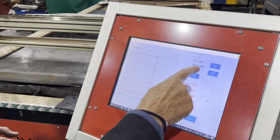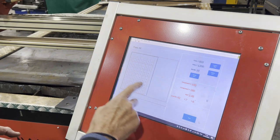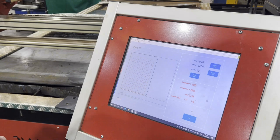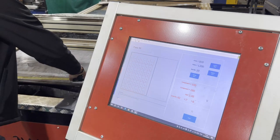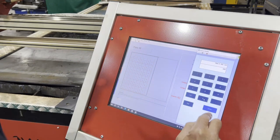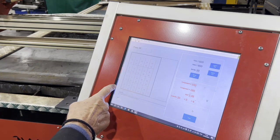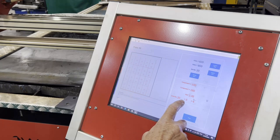What we've done now is it's got a virtual plate in there, 800 by 1200. It's calculated the size of the component and fitted them in an array nest. If you've got longer parts you might want to rotate them and cut them that way around. We need to measure our piece of plate and put proper numbers in, so we'll cut this 600 by 800. Plate size 600 by 800 — re-nest. Automatic compensation for kerf, so there's a kerf allowance in there. It tells us how many we're going to fit in: a row of 5 by 4.